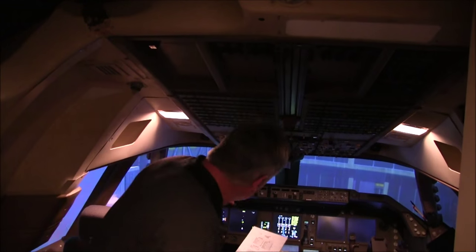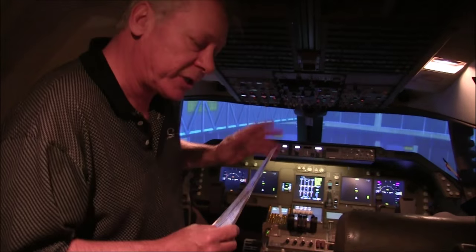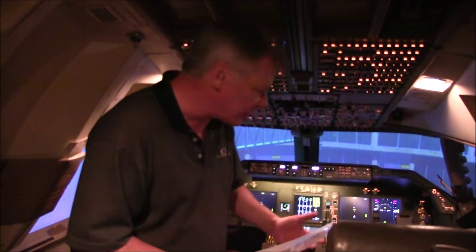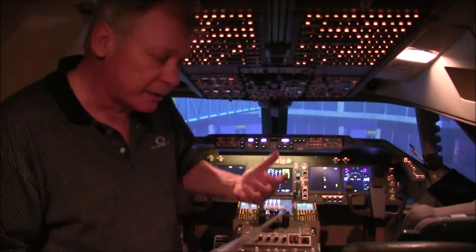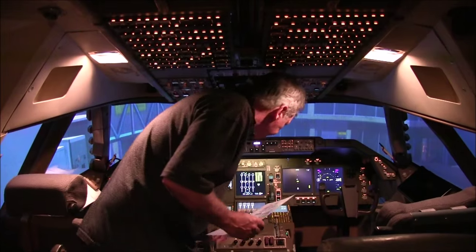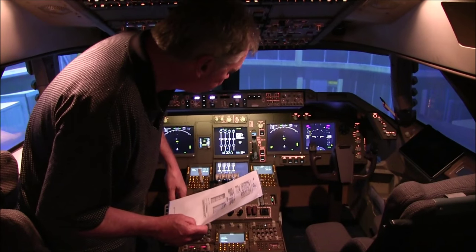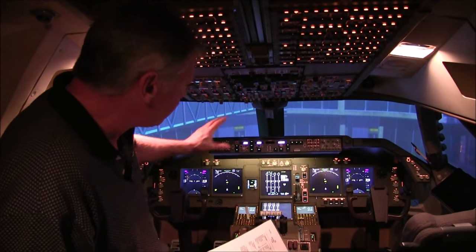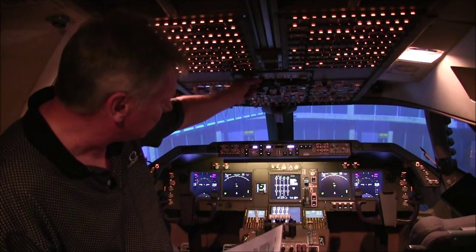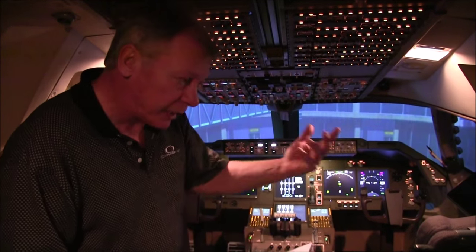Always a good idea to have both available. Left external power coming on now, and the right coming on now — the aircraft is now powered up. Before I run off to walk around the aircraft, I just make sure it's okay to leave. That means switching on the three IRS's to NAV — they're now winding up because they'll take a while. Check the EICAS; lots of messages always. Just watch for anything unusual — that looks perfectly alright. Think about whether you're going to put the APU on for air conditioning. If passengers are going to board, put the emergency exit lights to arm so they can board safely.